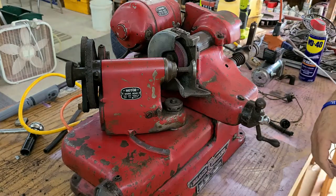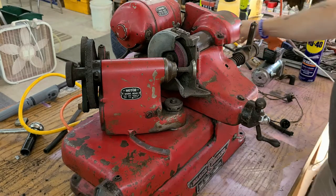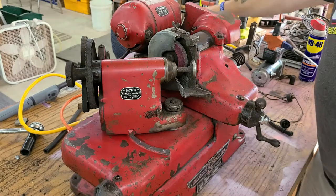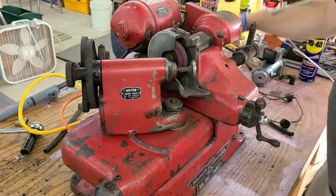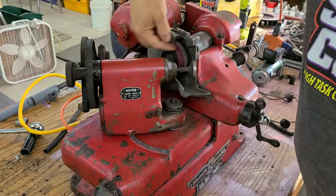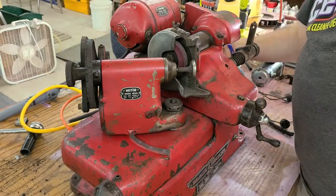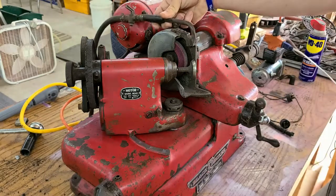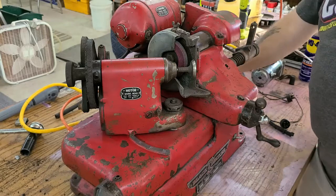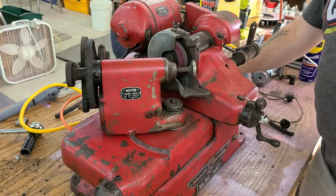Hopefully I don't have any valve stems in the near future that need serious work. This also has a pump that came with it — a reservoir pump — so you can pump your cooling liquid down here onto the grinding wheel. It's got a return nozzle on the back for a hose that comes up across the top and puts that fluid right down on the grinding wheel, so you don't create too much heat on your valve stems or valve faces.